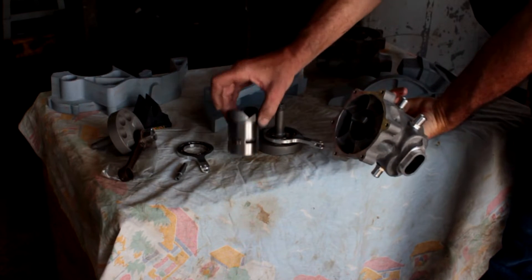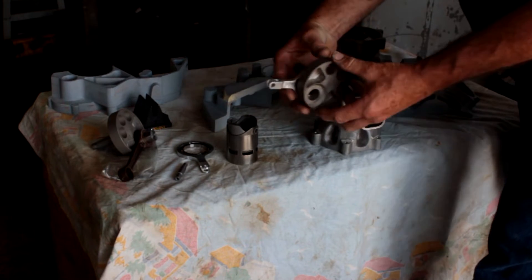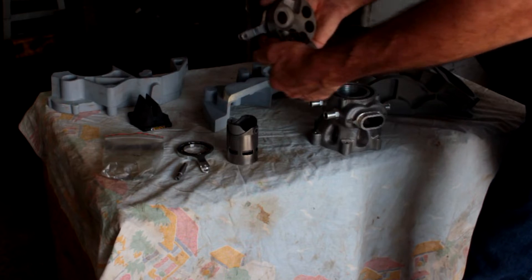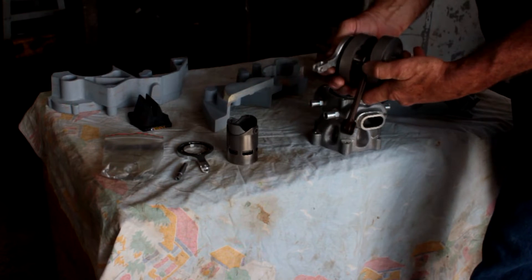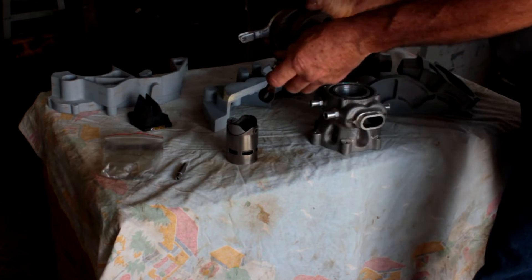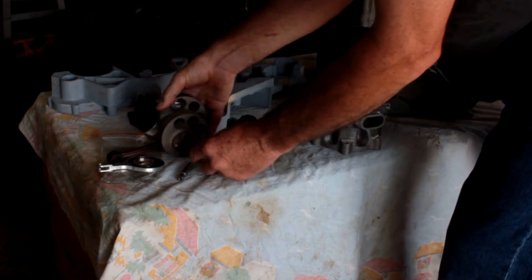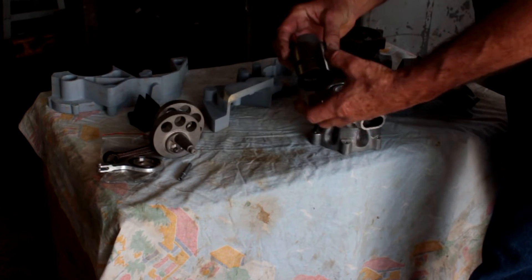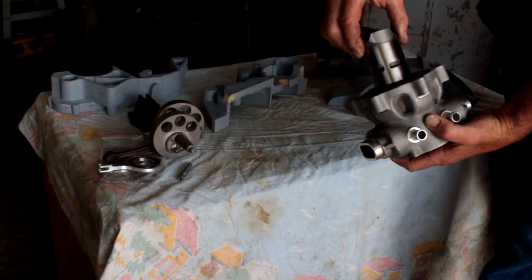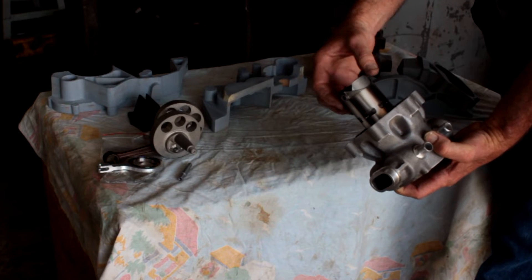That's the sleeve, that's the piston, that's the crank - with half of the crank with the sleeve drive. There's the other half of the crank, yet to be pressed together, with the other sleeve drive on the other side. They drive the sleeve, which doesn't actually fit at the moment - it needs machining and honing to make the sleeve fit, but it essentially fits up and down inside there.